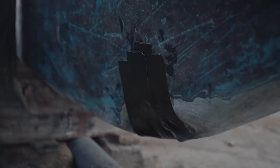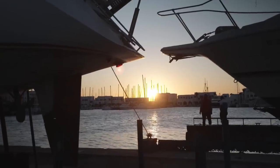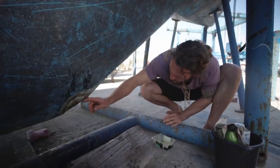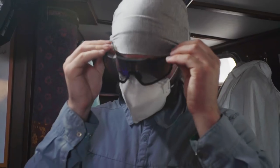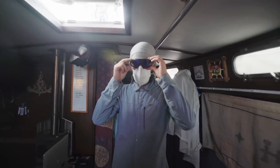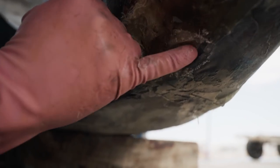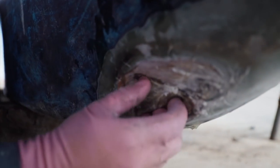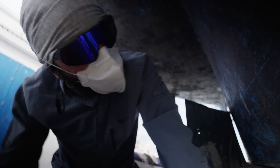Round one — we'll see if this will dry up. Some of it didn't quite take, but we grind it back. Water is still coming through. Even though the outside was dry, water came through before the epoxy bonded and then basically popped the whole thing out.